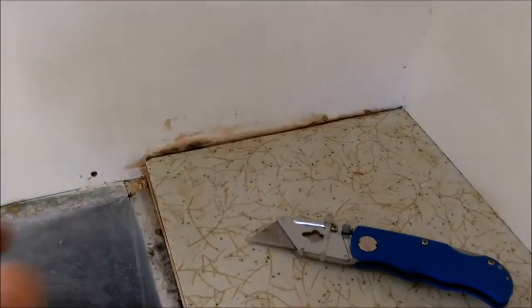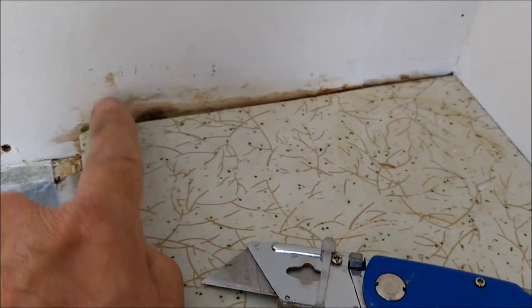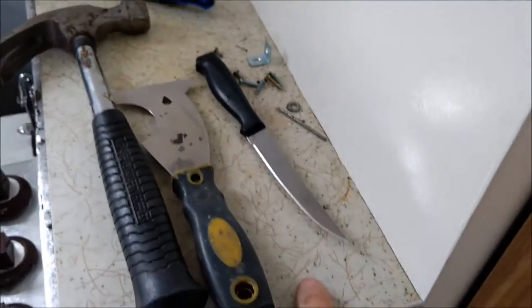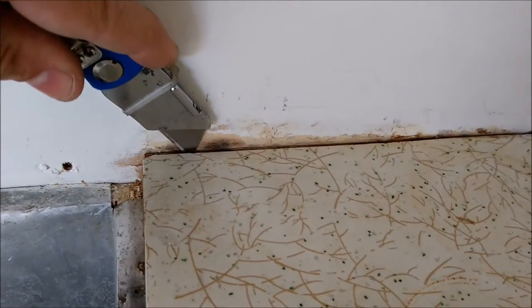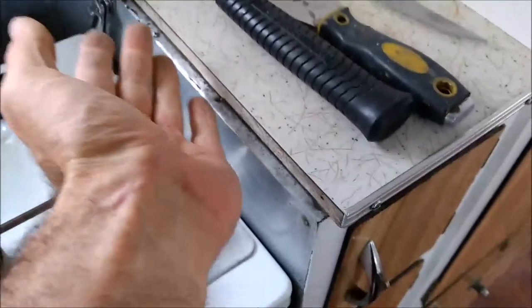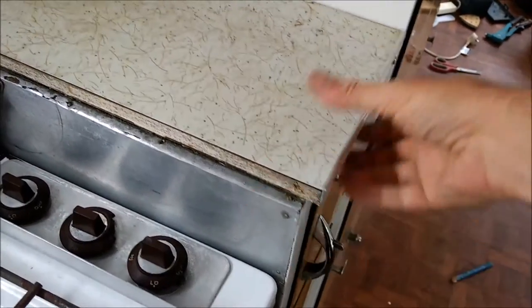As expected it ain't going to plan trying to get it out. I've got to be careful not to damage this and the wall behind it, so it's a bit of a mess. What I'm going to do is try to take this entire unit off. The first thing I've done is removed the nails that hold it on that side, and I know there's also a screw that comes from the back, just like the ones here were. So I'm just going to try to lift that and pull it out.